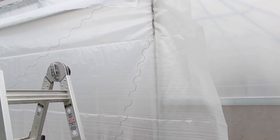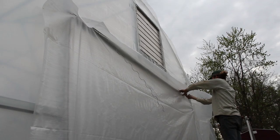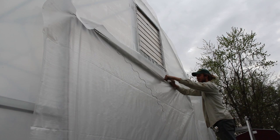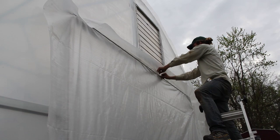For the next step, we're going to secure the entire top of this plastic panel with spring wire. But remember from previous steps when we drilled a hole through your header — we want to make sure the wire does not obstruct those holes. Using pieces of spring wire already temporarily secured, I'm moving from the stud towards the middle on each side of the top plastic panel. I'm holding the excess plastic at the top and running the spring wire until the two pieces meet each other in the middle, and then the top is all secured.